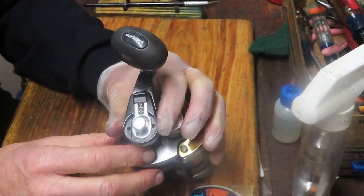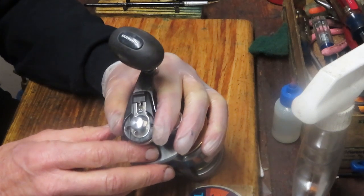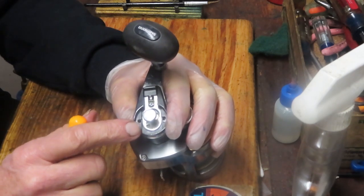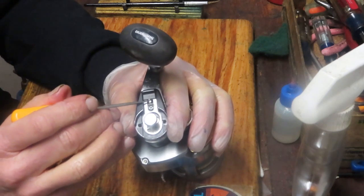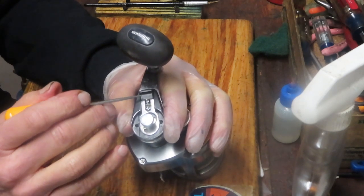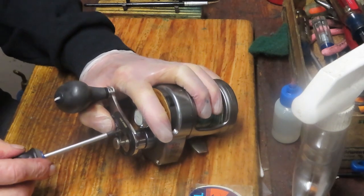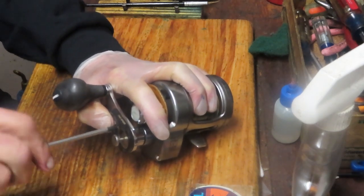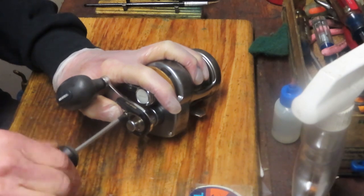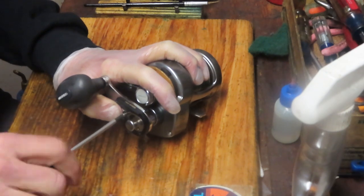This is a good place to tell you to take pictures of the assemblies, particularly if you haven't worked on these before, because it's worth noting the orientation of the pieces and parts — how they come together and how they come apart. If that nasty little spring here gets lost, you know how it's set in there. There's a little ridge that comes up on here. You can try pulling this off, or you can remove the screw and try to hold that assembly in place — that's my preferred approach.